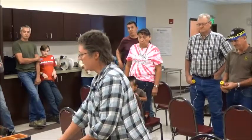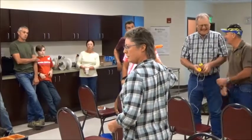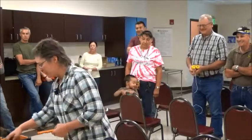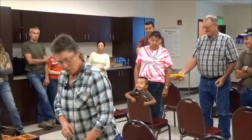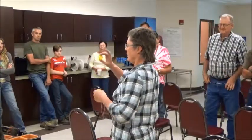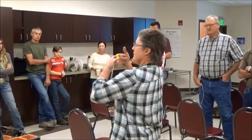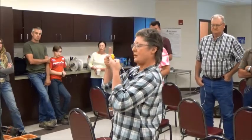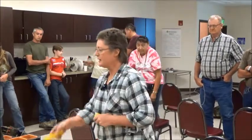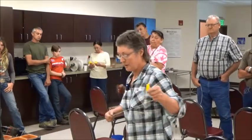All right. Now there's lots of, this is a cold handle, which is an insulator. If you're desperate, you can take an insulator and tie the insulator to your barbed wire fence at this end and tie your fence to the other end, and then you'll have a hot fence. Tisk, tisk. Always have enough insulators. That's part of your efficiency. But if you're desperate, okay.